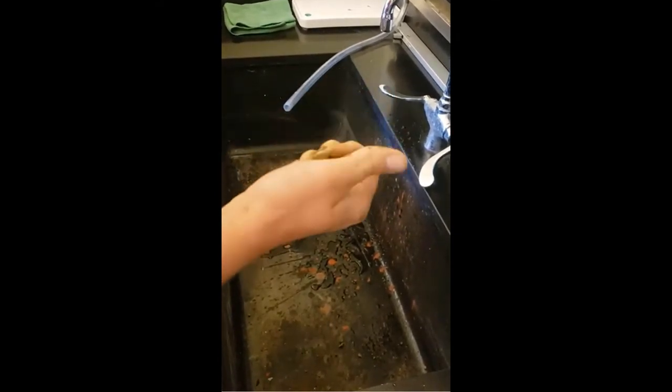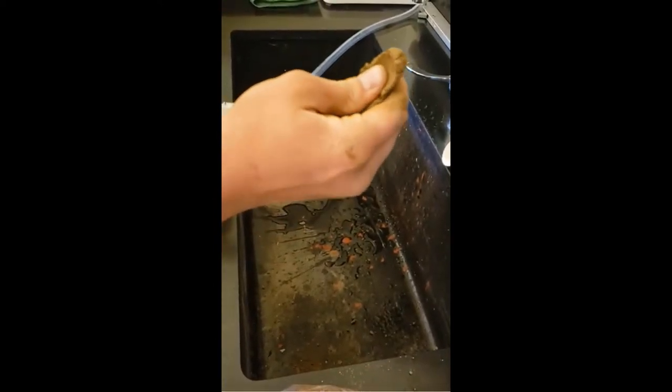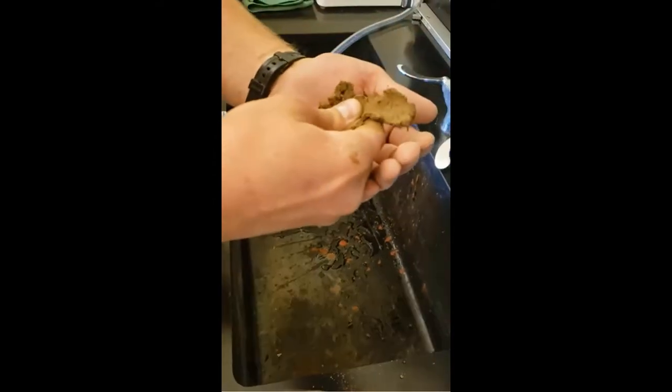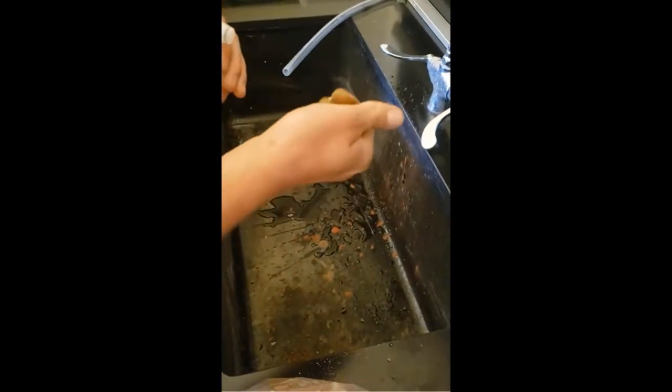What I'm going to do next is called the ribbon. You squeeze between your index finger and your thumb — I'm just slightly pressing up. I can tell you already that this soil isn't wet enough because that ribbon didn't stick together very well.